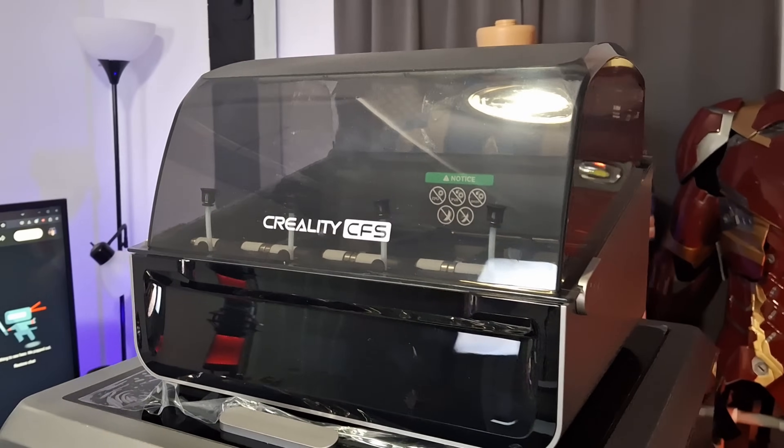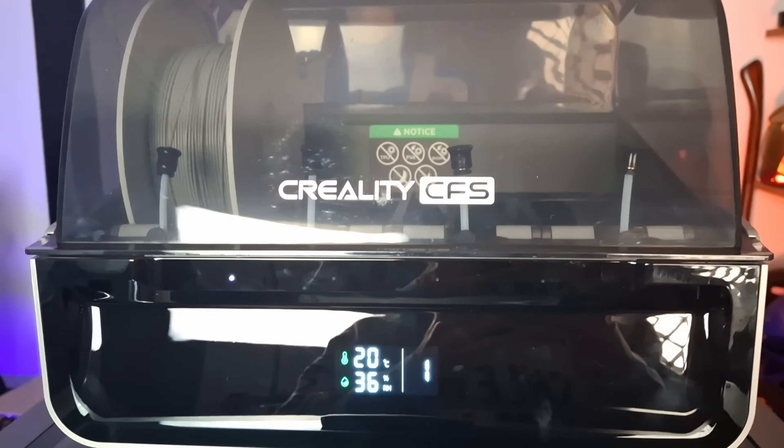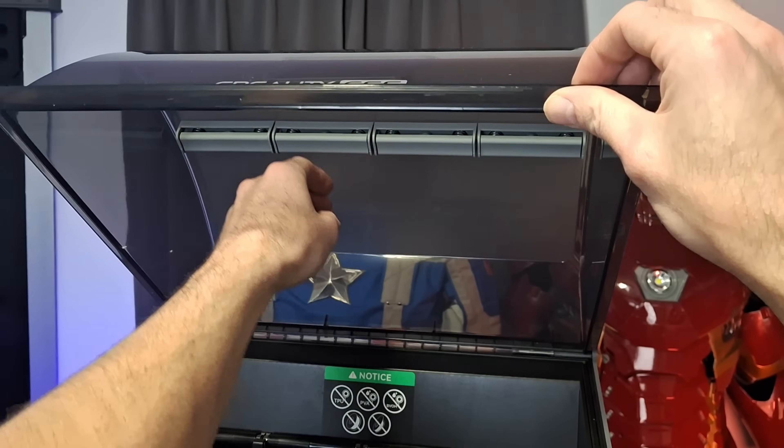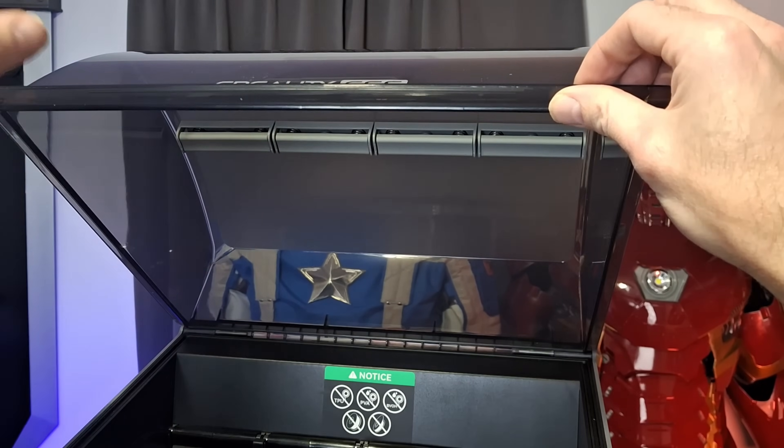Since we're talking about color changing, let's talk about the CFS system — their color changing system that is identical to all the other machines. It's got a nice LED screen that shows the relative humidity, and it has this awesome pressure bar on the top of the lid that keeps tension on the roll. So when they get lighter, it's putting slight pressure down so they don't skip around in the CFS. Creality is also now coming out with spools that have their own RFID system, so it will know exactly what filament type is in the loader, or you can just type it in manually.